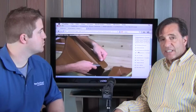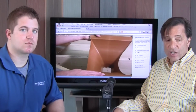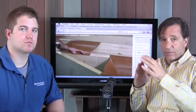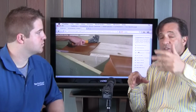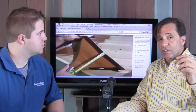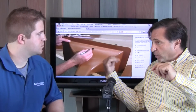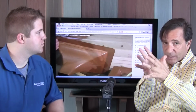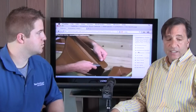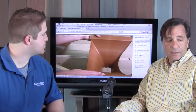So when you have a cantilever as opposed to a system that you put on after the deck is done, say for instance, a deck that's 14 foot out and you have 2x10s and you're in 12 foot, and then you have another 2 foot on the other side of the cantilever, you can still divert your rainwater either toward the house for a drain area or away from it, so you don't get boxed in with the cantilevered beam on that. Exactly.